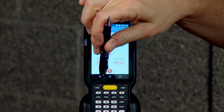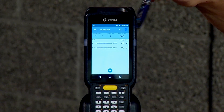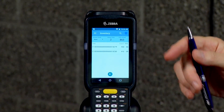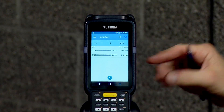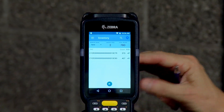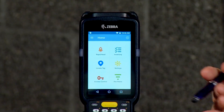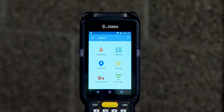So I'm going to go back and we're going to look at the inventory section now. If we click inventory, it's going to show you the same two numbers that were read in rapid read. But in this mode, we can reset it, and it's just going to read the same two tags. So we can go back out to the main menu again, and that's how you read an RFID tag with a mobile reader.